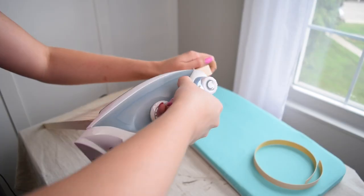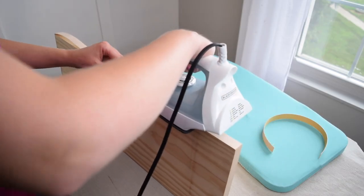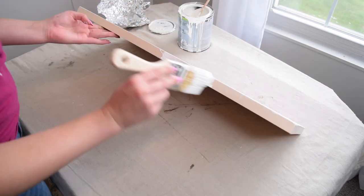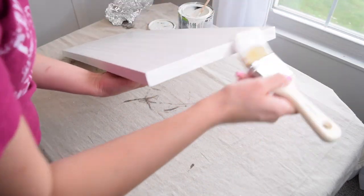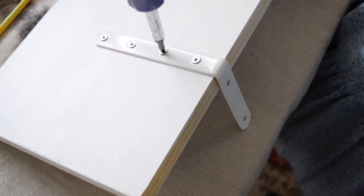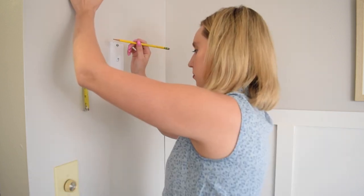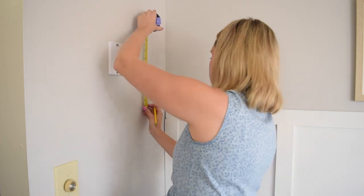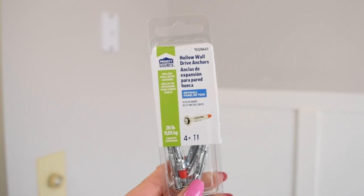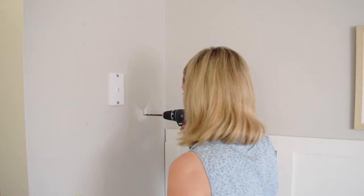The next issue I wanted to address is that my dining space is the only room in my apartment that gets a really good amount of natural sunlight, but I'm no longer putting the ladder shelf in the room since it just doesn't fit the vibe anymore. So I wanted to install my own shelves. I had some scrap boards already in my stash, and I used some veneer trim to hide the rough edge from the cuts. I decided to paint the shelves in the exact same color as my board and batten wall, which is White Gallery by Valspar. Once two coats of paint had dried, I attached shelf brackets purchased off Amazon, figured out where the shelves would go, and this is actually a decent hack to cover up that ugly phone jack on the wall. To hang the shelves, I used hollow wall anchors for the top hole and the regular anchors that came with the shelf brackets for the bottom hole.